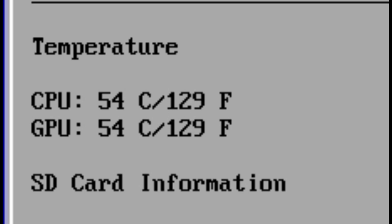So I did test the temperature with the top off of the NESPi case. I took it off, let it sit for about 15 minutes while running, and then checked it a few times after that, up to another 15 minutes. So about 30 minutes total. In all of my checks, I was getting about the same temperature reading, 118 Fahrenheit, 48 Celsius. Didn't really fluctuate much. It just kind of stayed around that with the top off.